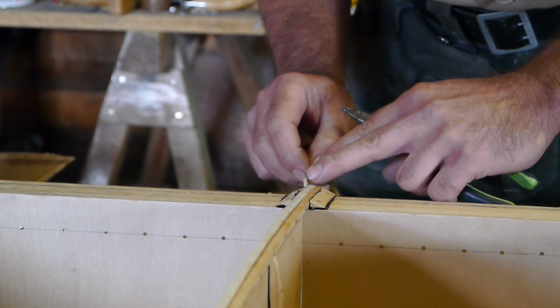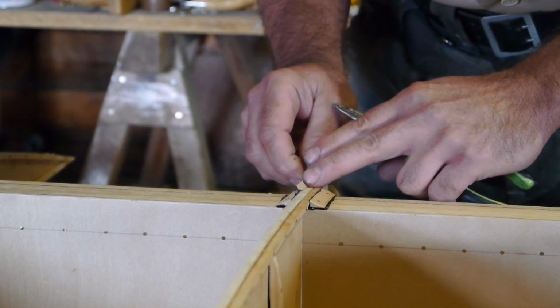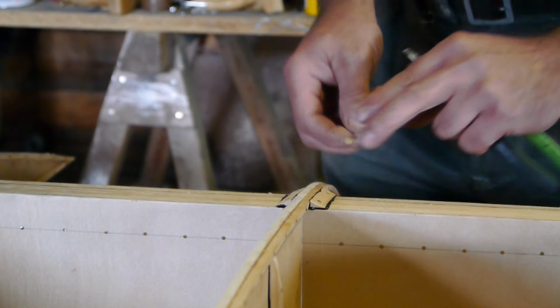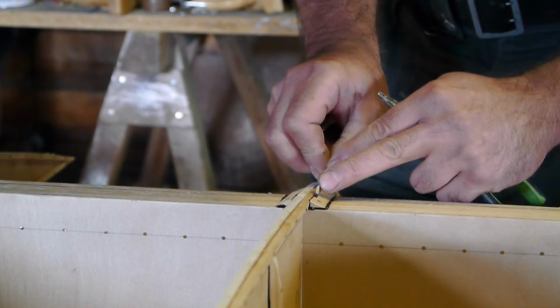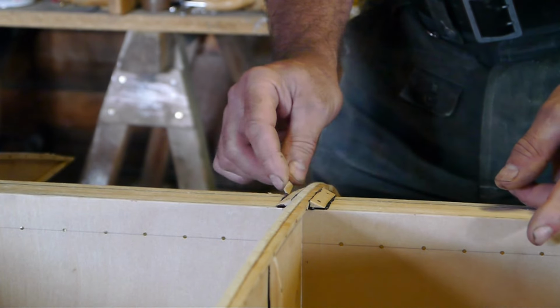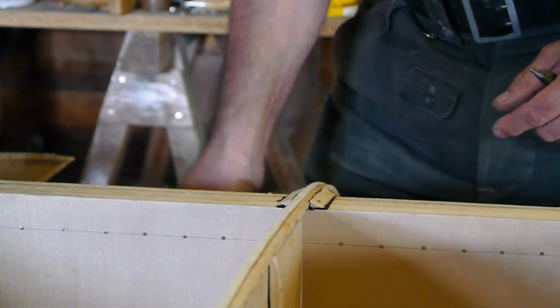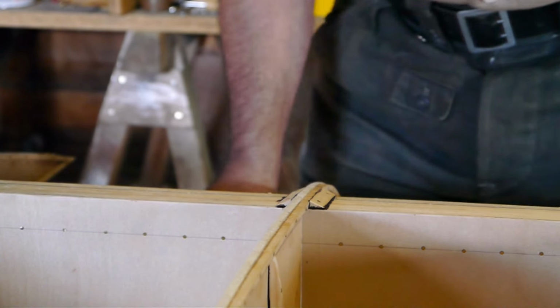I would not recommend wiping the stuff away with your finger, a cloth or even a brush. There are building inspectors who value a nice little caterpillar that may look nice, but I don't want it. I take a small piece of plywood and scrape it off, then it looks acceptable. The only thing you shouldn't do is smear the reddish stuff, otherwise the plane will look like it's been in a sword fight and is now covered and smeared in blood from top to bottom. Extremely ugly.